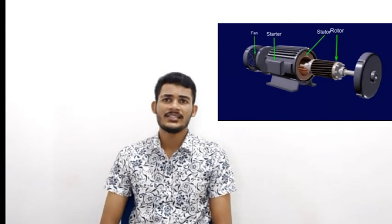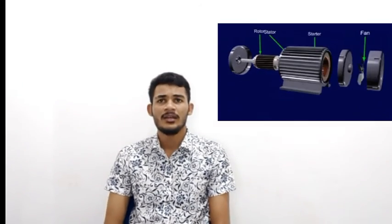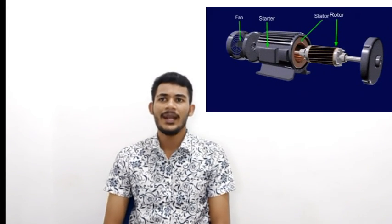As a conclusion, I want to ask you, is the DC shunt motor important for our daily life? My answer will be yes. DC shunt motors are ideal where precise speed control is needed, due to their self-regulating speed capability. The applications of this motor mainly comprise machine tools like grinders and lathes, and industrial tools like compressors